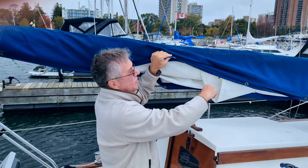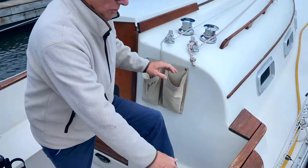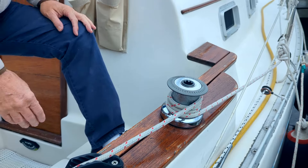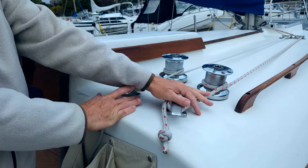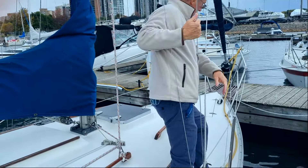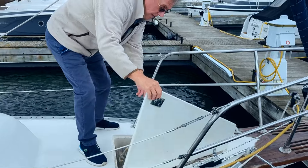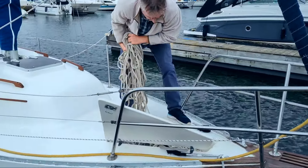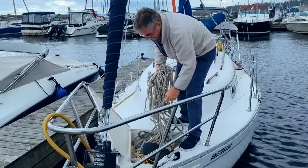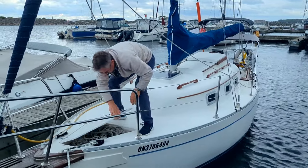Both sails are almost new. We have a few winches on this boat — this one is for the Genoa. We have a furling Genoa. The only problem with this winch is I would like a self-tailing winch, but it's okay for now. Up here we have winches for the halyard and for the topping lift — they're okay for this size. And then we have the front hatch. Here's our anchor locker. In there we just have the anchor, a Danforth. And we have our anchor ball — that's the anchor day signal — and I just string it between these two spots if I'm at anchor somewhere.